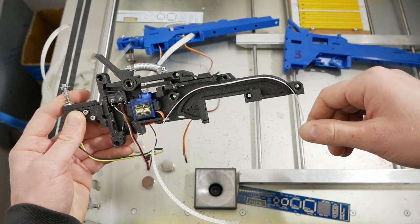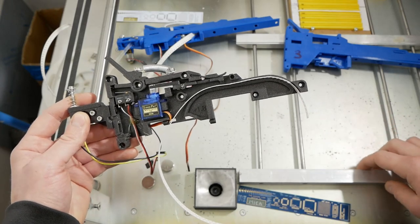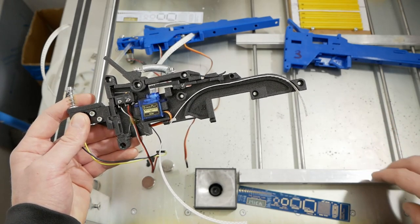However, the 0816 feeder is not compatible with my pick and place machine because the SMD tape is routed downwards and the base of my machine is solid. And I don't plan to make any holes for leftover SMD tape in it.